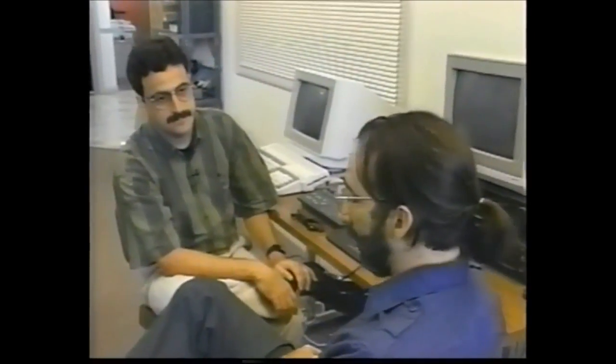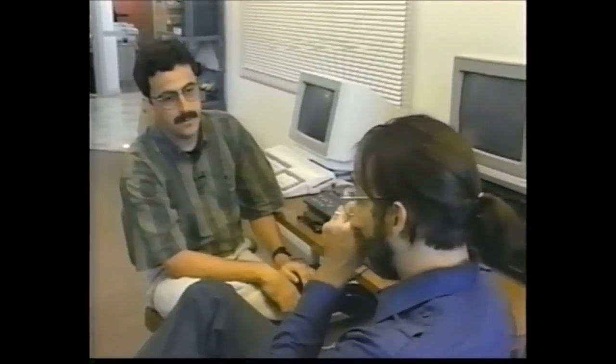Dave, I wanted to talk with you about how the VCRs and camcorders are controlled by these little decks. I'm sure we use cables, and I've always found it fascinating how inconsistent the industry is, with a lack of standardized formats. So let's take them one at a time. I think one of the most primitive protocols, that is, languages that machines talk to each other with in the consumer level editing realm, is Synchro Edit. Right. Synchro Edit is mostly found in the VHS family of VCRs and camcorders, and it's more or less a remote pause sort of affair where one machine tells the other machine to come off pause at a certain moment and start recording and then go back on pause at another moment in time.